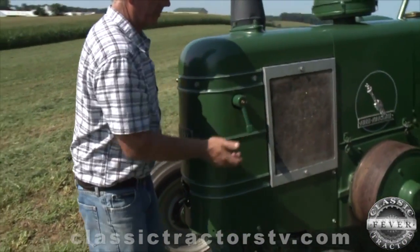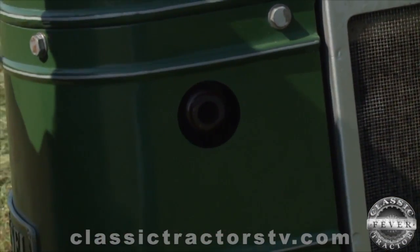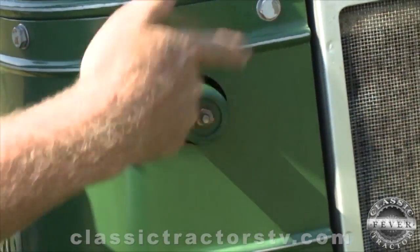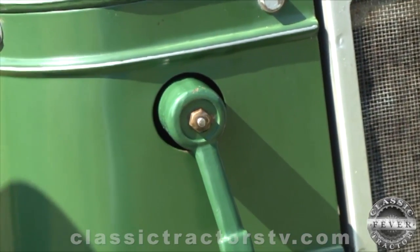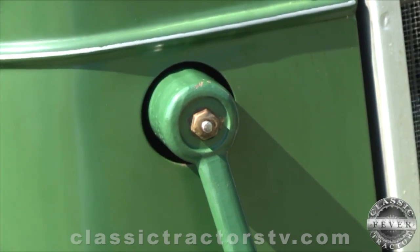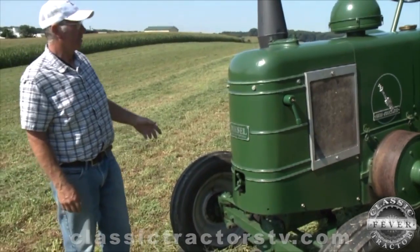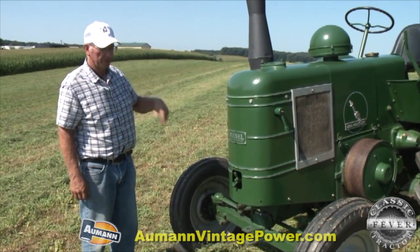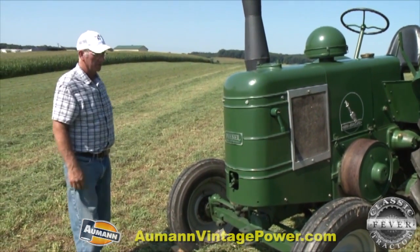And the final step would be to load your blank 12-gauge cartridge into the chamber here, close it back up, and hit this firing pin with either a hammer or a wrench. The charge would fire off, go through the compression relief valve into the engine, starting the engine turning over, and hopefully when it came back up on compression the next time, it would fire and continue to run. And generally they do, as long as your glow plug's still burning.